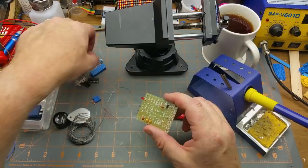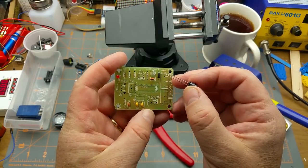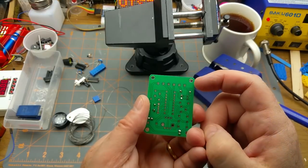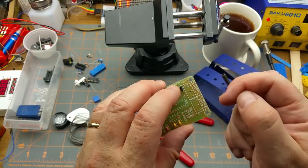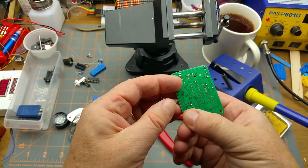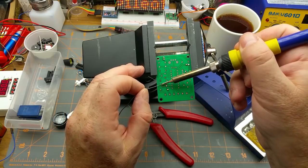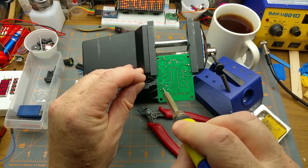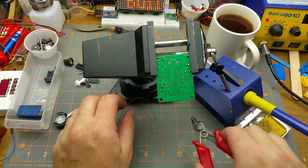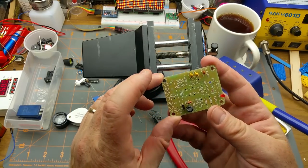There's an electrolytic. There it is. That says 100 microfarad. That says 220 microfarads. Remember I said I trust these guys? Well. Okay. So the negative voltage in and the ground are in parallel. And this capacitor just across the negative and positive voltage. Okay. So that is just power supply smoothing. So it doesn't matter that it's a larger capacitor than what the board silkscreen says. It'll actually do a better job. Or at least better at taking out large fluctuations anyway. So what next?